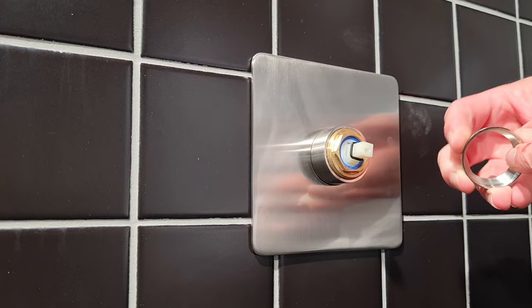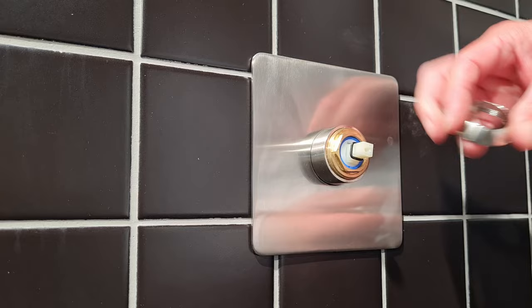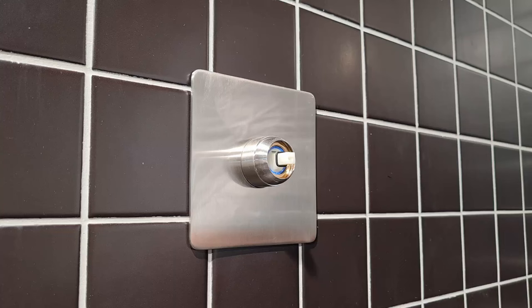For the dress ring, I'd just recommend cleaning it up a bit — clean the thread up. Sometimes you can put a little bit of CRC or WD-40 on the thread. If you don't have any, cooking oil is fine — everyone's got cooking oil. So just a little bit of lubricant, and then it slides over there. That avoids future corrosion as well. That just goes on hand tight — don't use any tool to put this on, just hand tight.